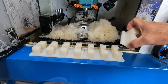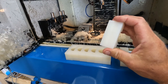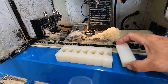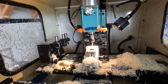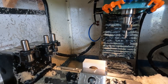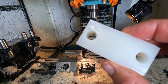This is step one of a three-step operation. Now I have to set them in the vise and surface off this face. All eight are done on the second process — nice and clean. Now we're ready for the third and final process, which is boring the holes for the through bolts that allow the two halves to clamp together and create the bearing. Here we are doing those final bores — you can see the part sitting in the vise, and once removed, there's a nice hole with a chamfer.